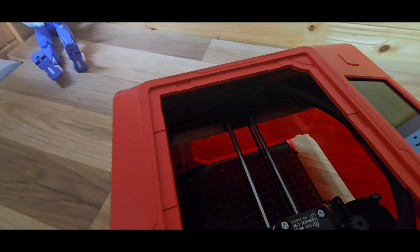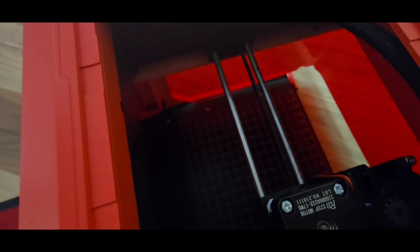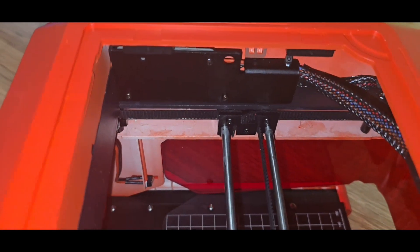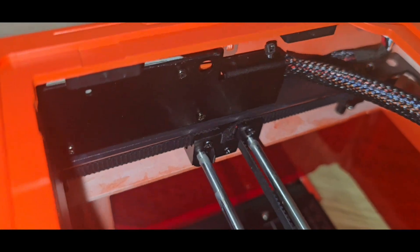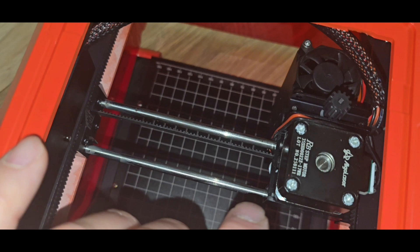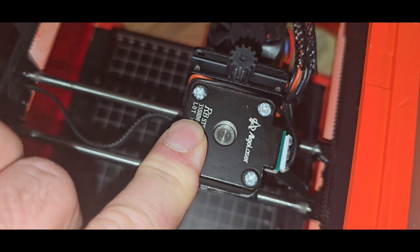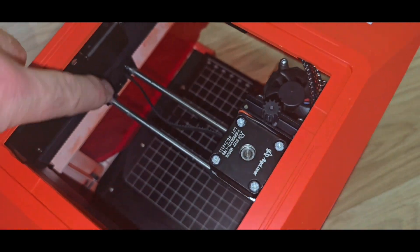Taking a look at the top of the machine, I'm not sure whether it's interlocked, but you do have access. It is a CoreXY setup, so you're going to get decent rigidity on the lasering. You can make adjustments here — near the motor there's a twisty knob where you lower and heighten your focal length.